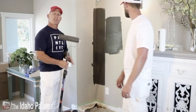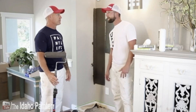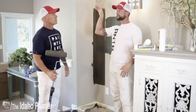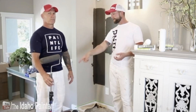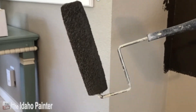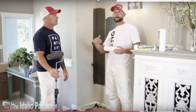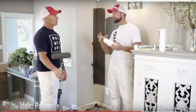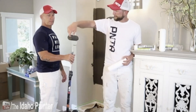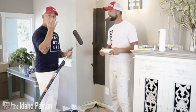Doing ceilings, doing your edge cut-ins. I would typically fill that in with a brush, and then hit it with a 4-inch roller after that. And now I don't have to do that. Typically where we're especially using it is something like ceilings. We'll have someone roll around if the ceilings are a different color than the walls. They don't have to climb up a ladder to cut it in. They can use an extension pole with a regular 9-inch frame, pop this roller on, and it saves a ton of time and work. That energy going up and down a ladder all day long — you'd be going up and down a ladder typically. Some people are going to get worried about having paint on the end of their roller and it flicking off while it's spinning, but the microfiber actually holds all of that paint in. It's like little fingers grabbing on.